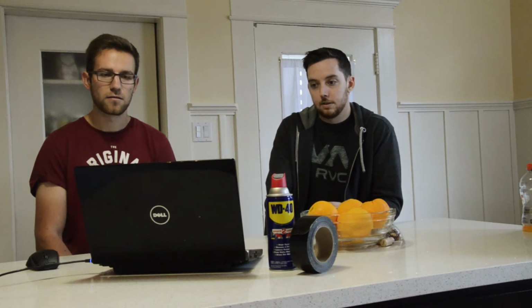And then we'd also like to look into maybe making some modifications to our sensor or choosing a different sensor. Mainly we'd like the temperature reading to be faster and more accurate, because currently it's attached to a large piece of copper wire, and while copper is able to change its temperature fairly quickly, it is a large piece of copper wire, so it does take a little bit longer to respond to temperature changes at the sensor.